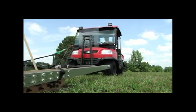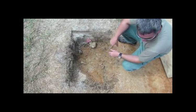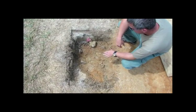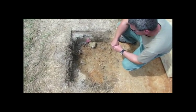We're here at our IVS lane in front of a test pit in which we've located a 37 millimeter projectile that we're going to use as a baseline to establish a minimum magnetic signature of what we'd expect to find on our site. We have a test pit that we put various items in to double-check the performance of our instruments.